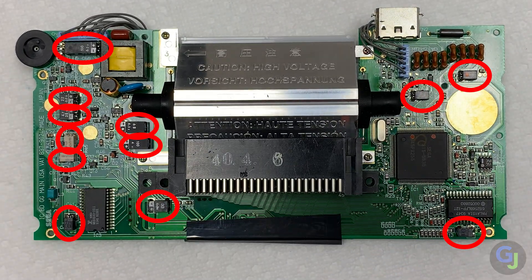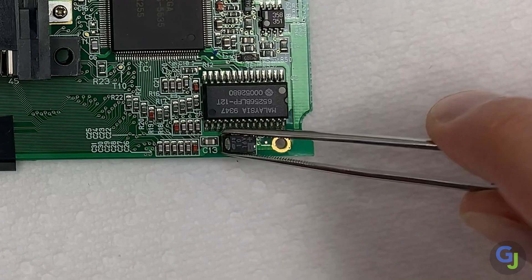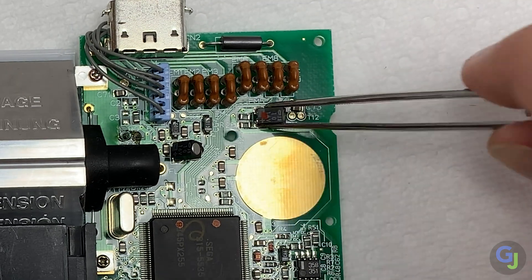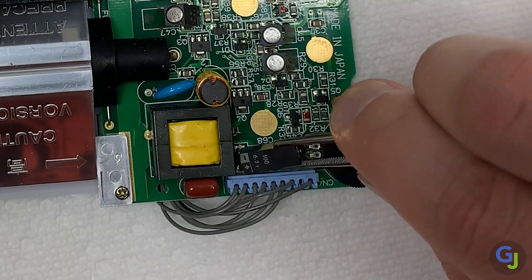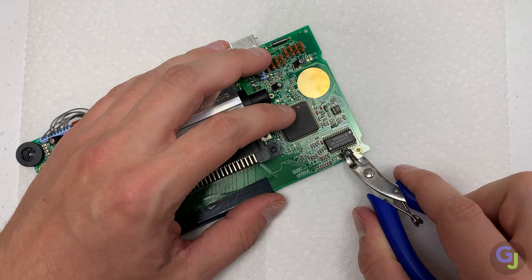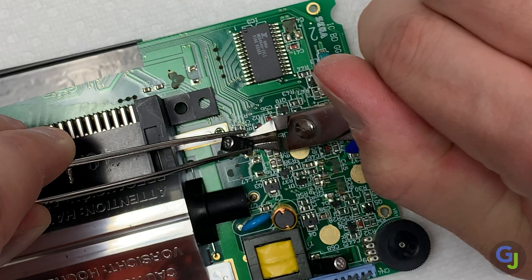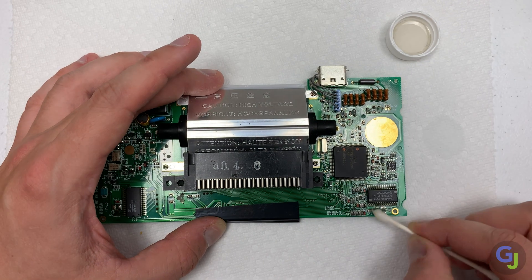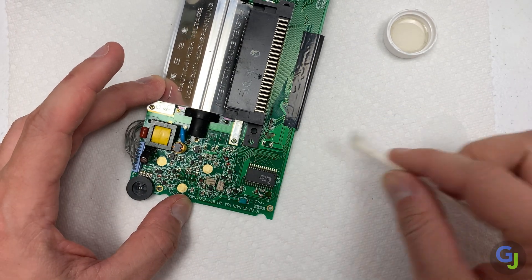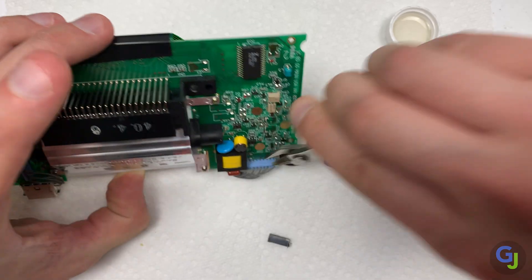There are a total of 12 caps on the main board to pop off. They are all glued to the motherboard — I like to take a pair of tweezers and break them all away and tilt them upward, then go back and cut the legs with a pair of side cutters. You may have noticed that these are SMD parts, or surface mounted caps, and we have through-hole replacements. This is very common to see in the replacement kits and is actually a bit easier to install if you only have a soldering iron. After cutting away all the old, I like to go back through and clean up all the areas with IPA in case some of them were leaking.